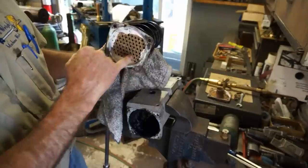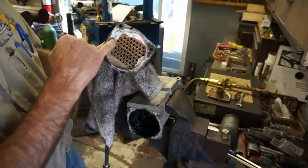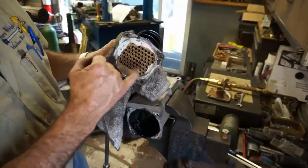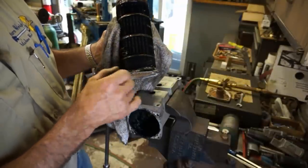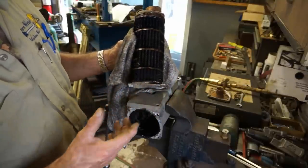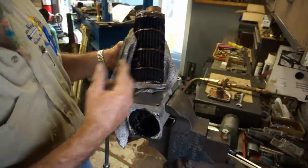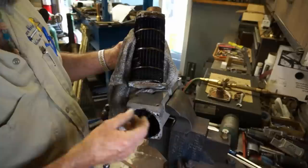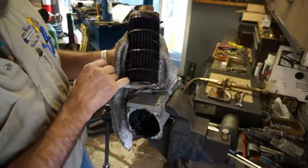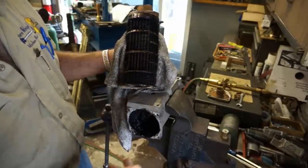So you can see why you need to pull coolers and stuff like that apart. It's not just this side right here that you have to contend with, and then the zinc anodes failing, and then it's starting to eat on some of the other alloys like the solder that holds these things together. See, the electrolysis will go for the softest material of the mix of the alloy first, and then progress to the next and the next. But on this side here, you also have filth that you have to contend with because you have particles from within your oil.